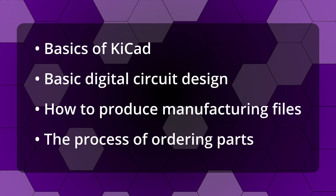I also learned about the process of ordering parts from a PCB manufacturer, which becomes more complex when you want them to place the PCB components as well. You can either buy the components and have them sent to you separately, or have the PCB manufactured with the components included, like I did. This is a bit fiddly because you have to match the components you require to parts from the manufacturer. They do a good job of automatically matching components, but sometimes you'll have to manually search for parts on the manufacturer's website yourself.